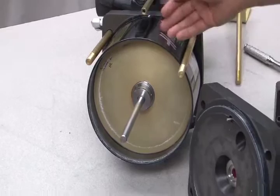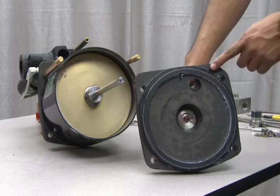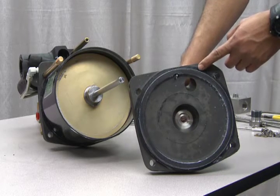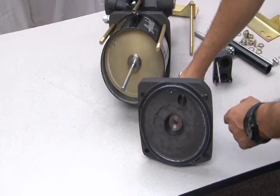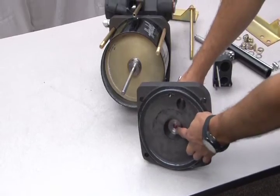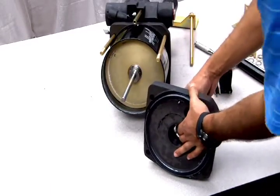The inner plunger has an o-ring running around its outer diameter that will need to be replaced. Both of the barrel end caps are also identical and have o-rings where the barrel fits into the cap, and both have inner packings for the pilot stems located here. On 8-inch models, you also have additional seal packings located here in the center. Push these parts out by hand to inspect and replace any worn parts.